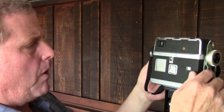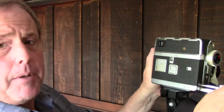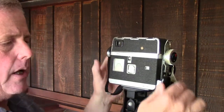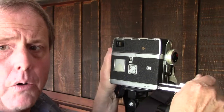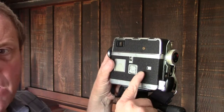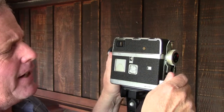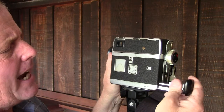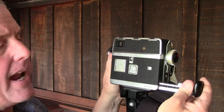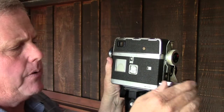As I wind through this, I'm at number two. Always go all the way to the end, all the way back in, because we're only hitting that counter at the very end of our travel. If I go slow, I can see I don't hit the counter until right there — way at the end. Just that last 10% of travel is what trips that counter to number four.